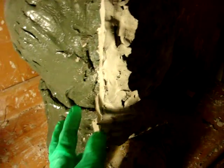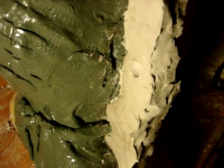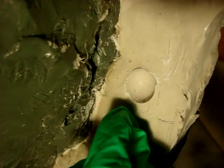Okay, I just finished taking out the clay dividing walls and the containing walls, and as you can see, it's a bit small, but that's okay. Usually, if you make your molds bigger, it's easier to take out when you're demolding it. When you take out your clay dividing wall, and when you did the registration keys, it should leave a hole right where the marble was. So that's the registration key.